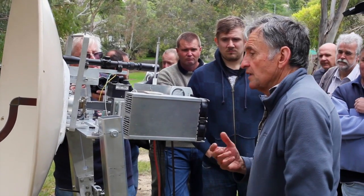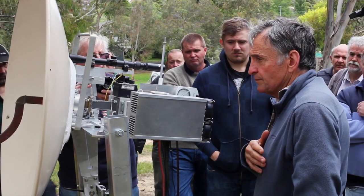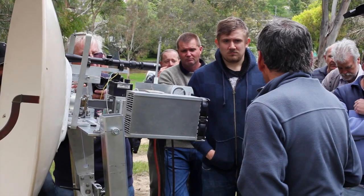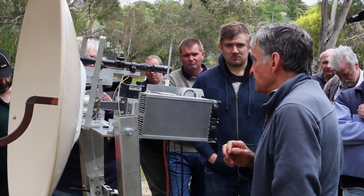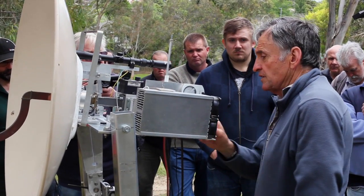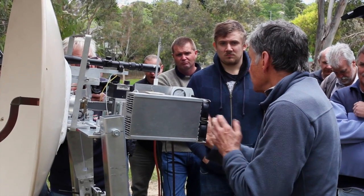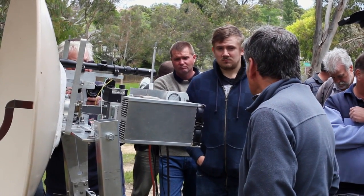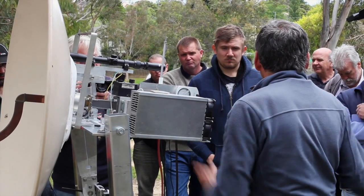We transfer it down to 144, and we're going to use the mode called JT4F. Now JT4F — people wouldn't generally be familiar with it. Most of you are familiar with JT65C on 2 metres and 432. The problem is, when you get to these sort of frequencies, the bin width of JT65B, for instance, is only 4.8 Hertz. And when you get to these frequencies, you get doppler shift — differential doppler from both sides of the Moon — which spreads the signal out, sometimes as much as several hundred Hertz. And obviously you can't use bin widths of 4.8 Hertz if the signal spreads several hundred Hertz.